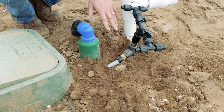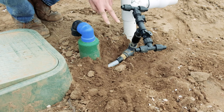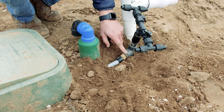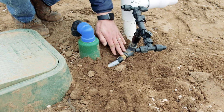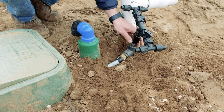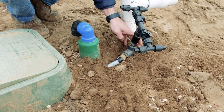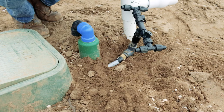This is the pressure switch that is also connected to the valve station, and the valve station can take two of these. You normally put it on the irrigation line that the valve is controlling. This pressure switch has a 7 psi threshold, and when the water pressure inside this line gets above 7 psi, this switch closes and our device gets a signal that the water's running.